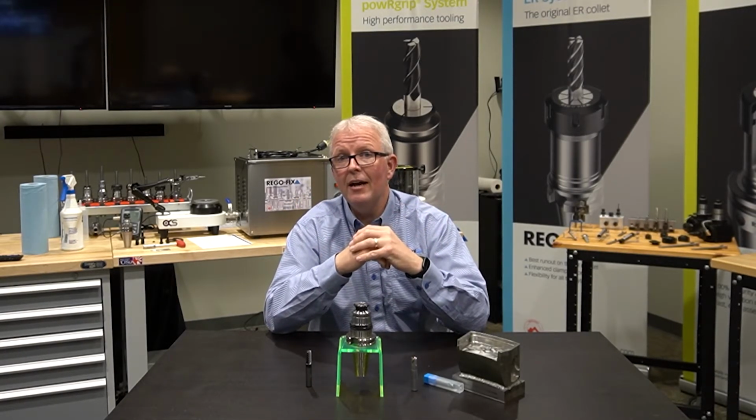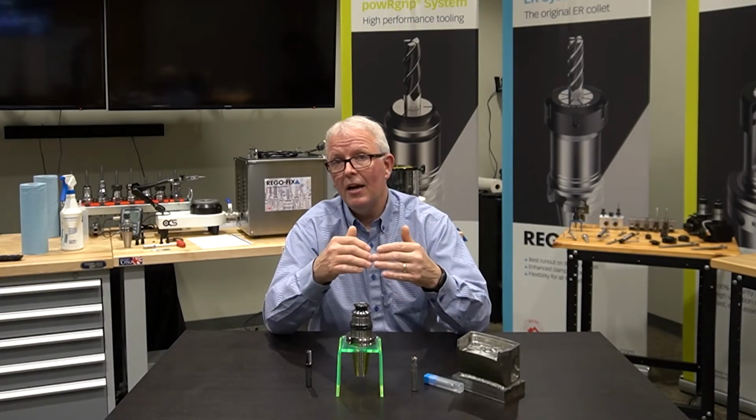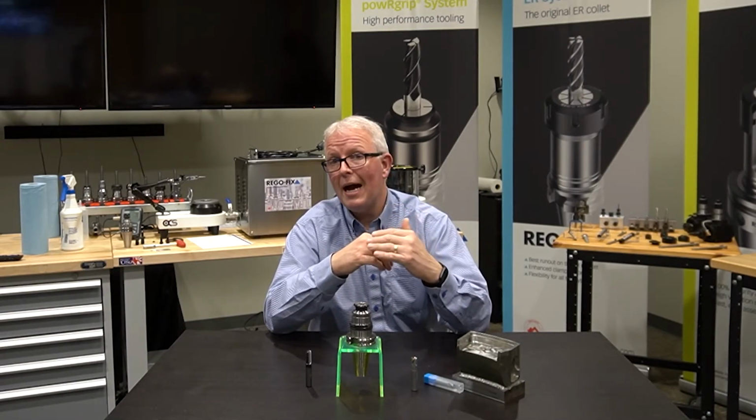So, no real issue with the heat, no real issue with the vibration dampening, and as mentioned before, that 3 micron TIR, that repeatable, easy to set, easy to use TIR and assembly process just makes powRgrip a very good option when we talk about ceramic end mills.